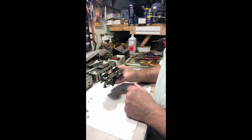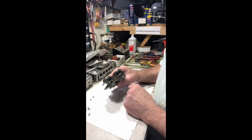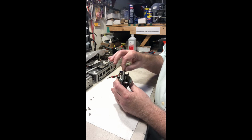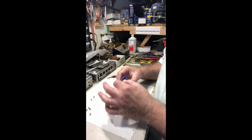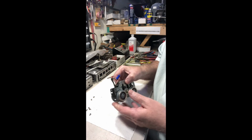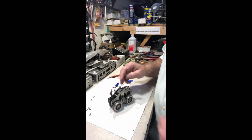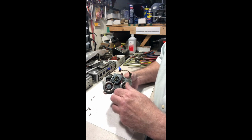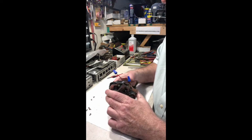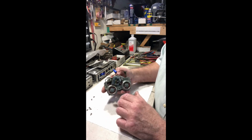So I took that plate off the old contactors and used a new board, new contactor set, and I re-riveted this plate on there, and we rewired, came up with one single contact for positive off of the rollers. And if you remember, the old motor, the wiring had a little sock on it to insulate, to keep things from rubbing together. I like that, so I used it over and brought up a new wire, and we branched off of that for a light, for a future light. And we took the positive wire to the bottom brush, and we took the other out of the other side of the field coil and brought that wire to the upper brush, and that will complete the circuit.